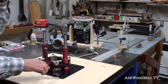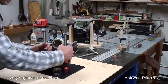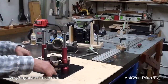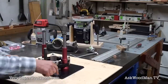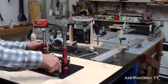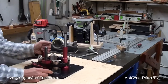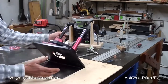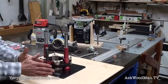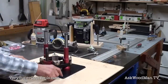It'll keep it from lifting after I get it set in position. It's going to have a lot of ability — these guys will push on the side to make sure that it can't jiggle this way. Set screws will raise and lower it and level it. After I get it in there, I'll just drill through, mark that through my tray, and drill down into that corner. I'll put a corner bracket on it — there are some real nice counter-sunk bolts that'll go in the four corners. So I've got it level side to side, can't move there, can't shift, and if the router bucks it can't lift out because of this.